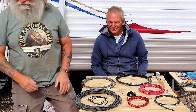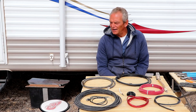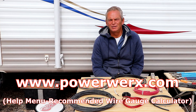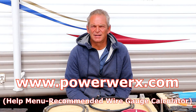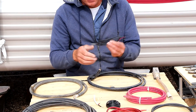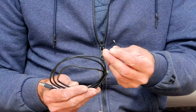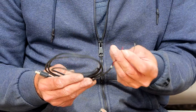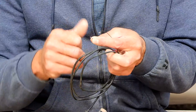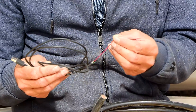The thicker your wire, the more current you can carry. There are online calculators that will tell you: if you need to carry this many amps for this far of a distance, use this gauge of wire — we'll put a link up for one of those calculators. To give you an example, this is 24 gauge. It's being used in a USB cord and it's made to carry an incredibly small amount of current. You can see these wires are incredibly small — so small that none of my tools will actually strip them. I generally use a pocket knife and just roll it against the blade to strip it. I'm sure they make specialty tools for it; I just don't use this gauge very often.